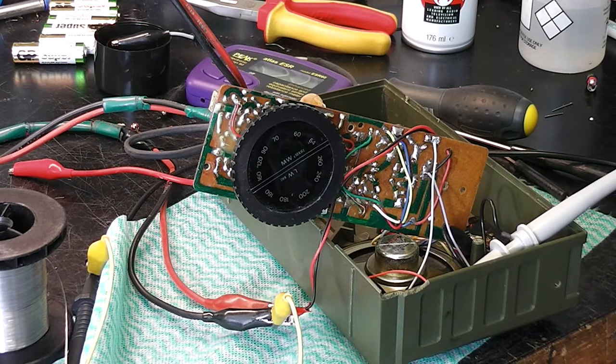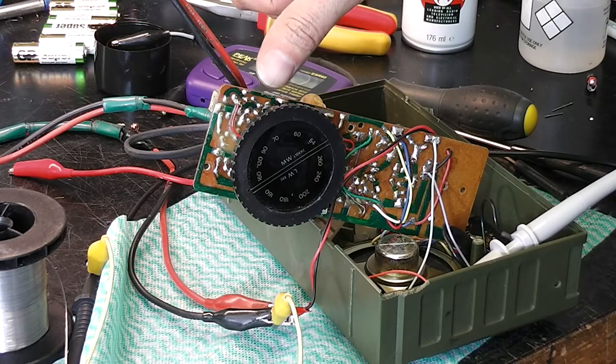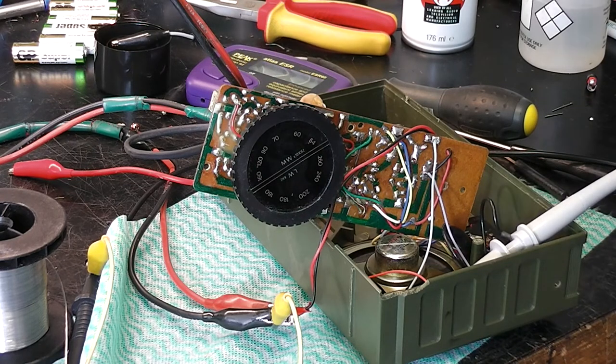I'm going to look suspiciously at the detector IF core, which seems very close to the top. Has the phantom twiddler been in? No, maybe not. Oh well, we'll have to see what the rest of the capacitors measure. If I've got one capacitor that's gone open circuit, it's possible I've got more. Though it'd be fun to keep tracing faults, I think I'll check the other capacitors first and then we'll see what we get from there.